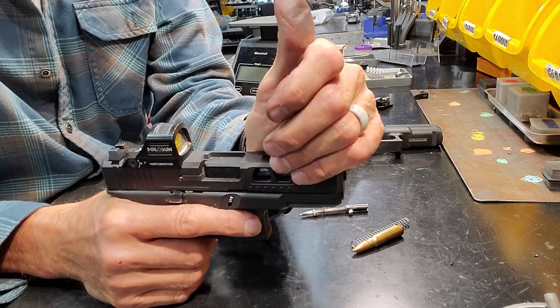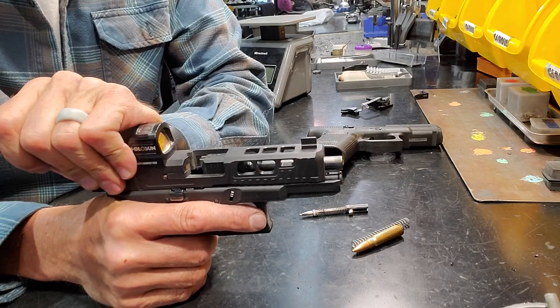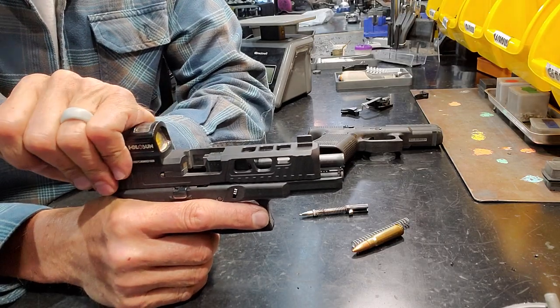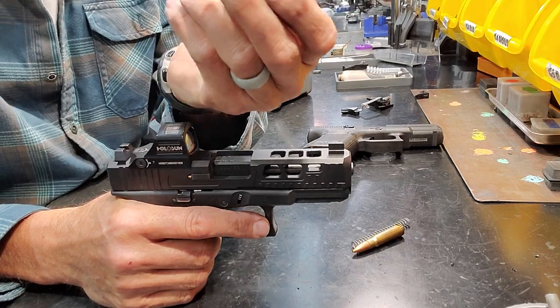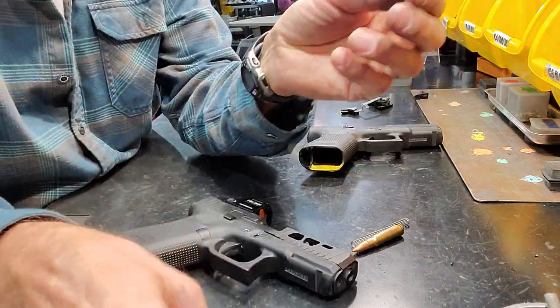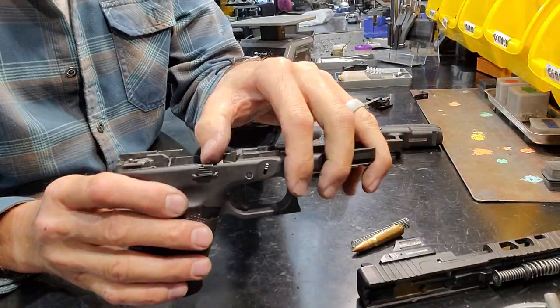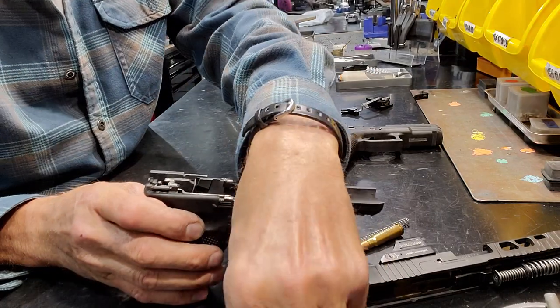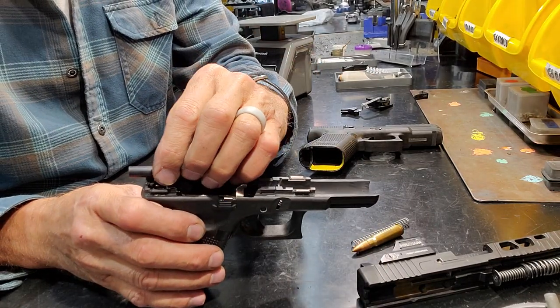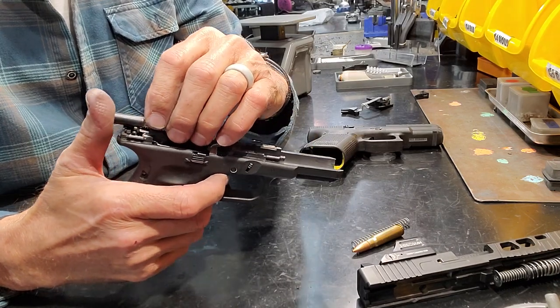see what's happening? It has now completely changed the mechanism. And why is that happening all of a sudden? It's happening because it doesn't have to contend, this is a 4.5 pound spring, it doesn't have to contend with the cruciform kick up grabbing the striker lug face when it comes back in to battery, like so.